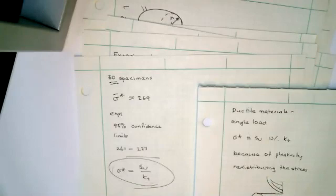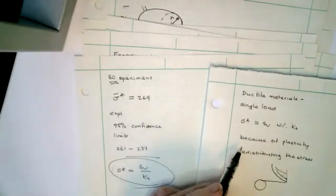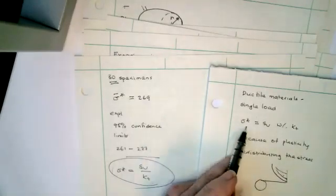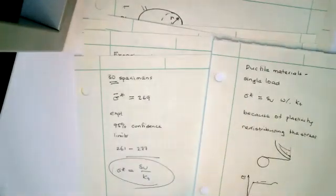And they do this for a stress strain curve. That's elastic. They have a little bump at the end. There is some truth to this. This is not wrong. Plasticity does smooth this out. On the other hand, there is no material in the real world that has a stress strain curve like this. Even lead work hardens. And because of work hardening, this is not quite right. Actually, what happens here is sigma star is a little bit less than SU.